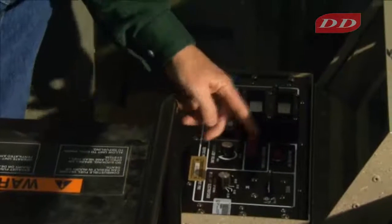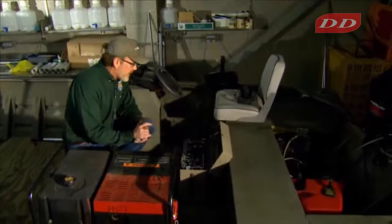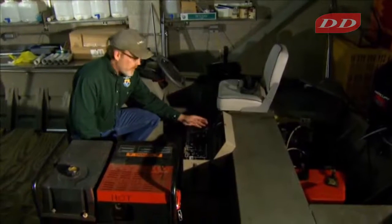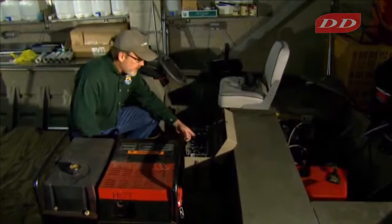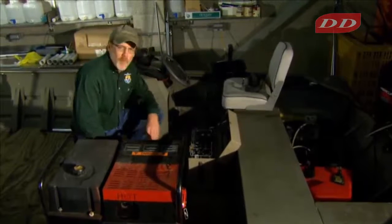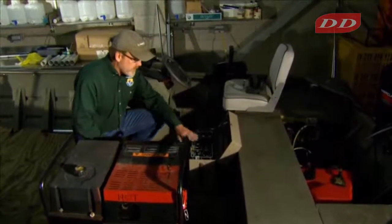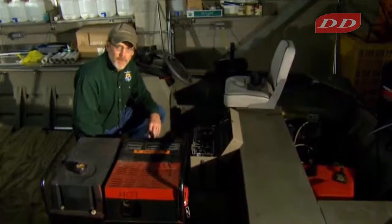And at the control box you can select waveforms, AC, DC, that sort of thing. But the most important thing on the control box from a safety perspective is the metering, so we know that electricity is actually going out into the water, and a shutdown switch, an emergency shutdown switch. So this is a slap switch type of switch, and important because if something happens and you're in the driver's seat, you can reach down, slap it, and the electricity is cut off at that point.